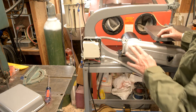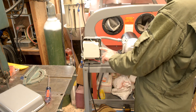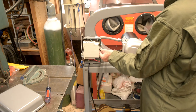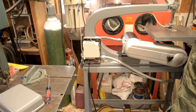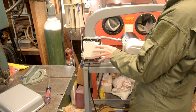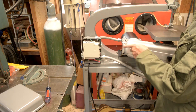I programmed it so that the external on/off switch will run it, but the internal potentiometer will control the frequency. So if I need to change the speed, I can just open up the cover and manually turn this dial. Also if I'm working on it and I turn it on and need to make some adjustment, I can also turn it off on the keypad. Another thing this drive will do is you can program how fast you want the motor to accelerate or decelerate — I had it set to five seconds.